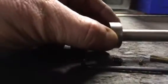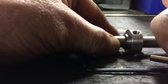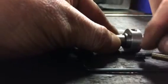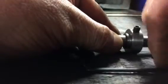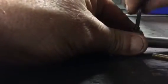So the shaft slides on. If you notice the nugget, I haven't even bothered deburring it — I've just literally cut it off and dropped it into the hole, put the grub screw on top, lock it down, and what will happen is the brass will actually deform to the shaft and the grub screw then doesn't bite into the shaft.